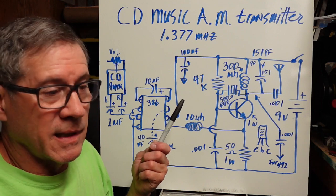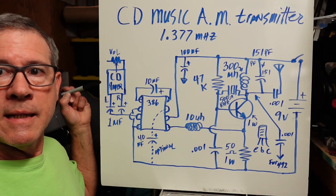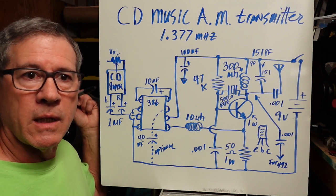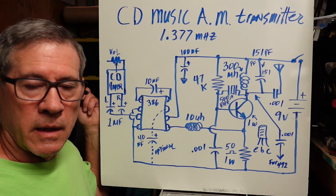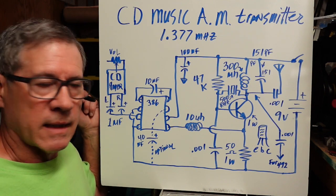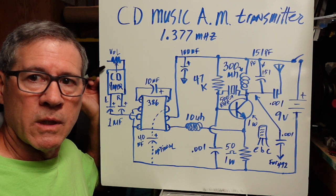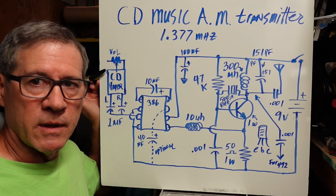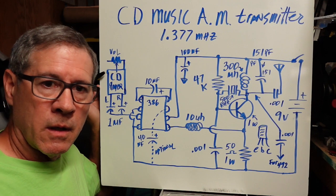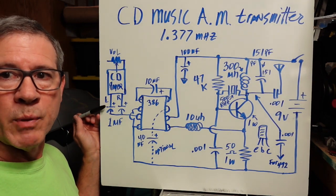This sounds very good. Here on the CD player I have an old boombox with a headphone jack. If you have a rack system with a receiver and speaker outputs, don't hook the speaker outputs up to this — it's the wrong impedance. This is for a headphone jack. Keep the volume lower, because if it's too loud it will introduce distortion into the transmitter, and that goes right to the receiver. Turn that down and turn the volume up on your receiver instead.